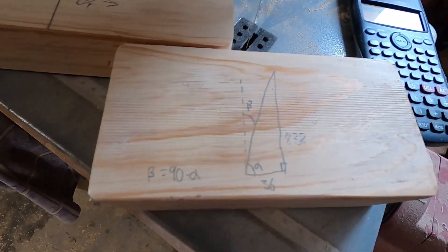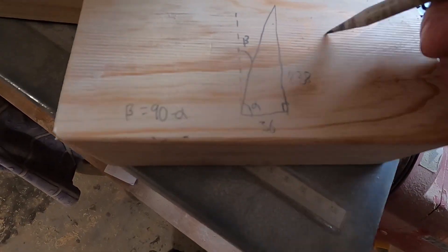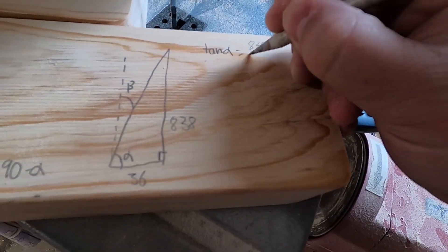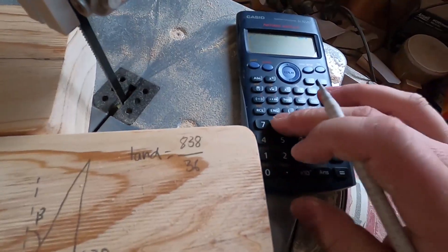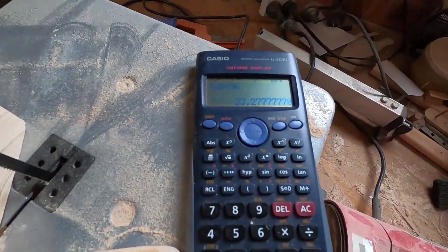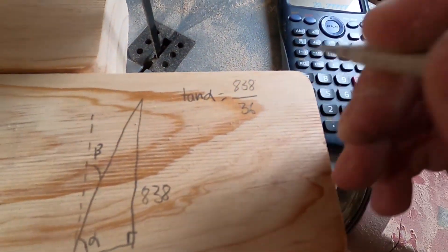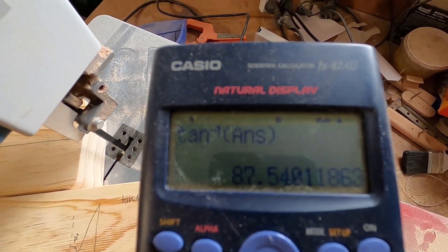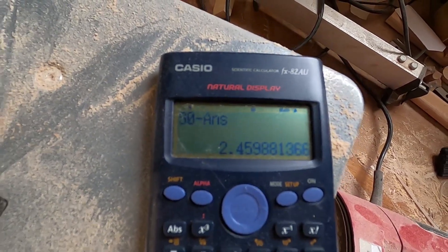The height of the mast trunk is 883, minus 45 equals 838, and the offset is 36 millimeters. If I remember back to my school days, tan(alpha) equals 36 over 838, so alpha equals inverse tan of 0.043, which gives 2.459 degrees - close enough to two and a half. Sanity check passed, the numbers look like they check out.